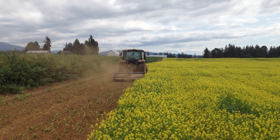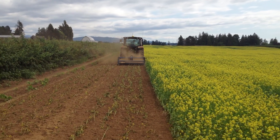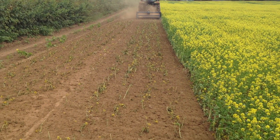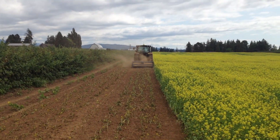Pretty sandy soil. He is riding on the skid plate on the gearbox, which means at the moment he is a full 14 inches down — full incorporation. That's kind of what he's planning on doing here. You get all the performance of a disc; you're going to plow and everything else in one pass.